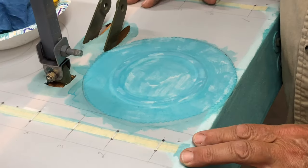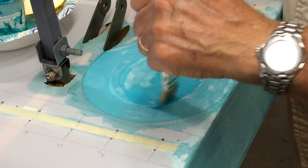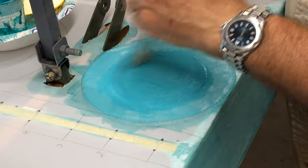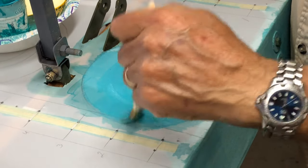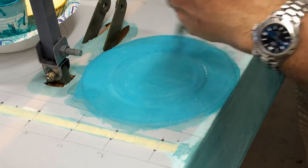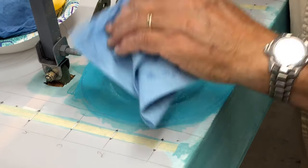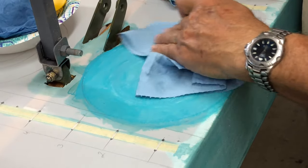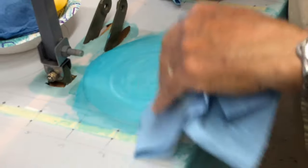So I'm going to go ahead and take my brush. Again, I'm going to take full strength glue, and I'm going to work from the middle out. This is going to be a top coating of glue. Whenever you have a top coating of glue, you must do the wipe off with the blue paper towel. If you don't, the rough glue surface you're leaving will be there permanently and it will show through your EcoFill and through your top coat. So make sure we get this wiped off. I'm working fairly quickly because I don't want this to set up. Make sure I get the entire surface wet out. Then I'll go ahead and take my dry paper towel and from the middle out grab a new one. I'm just working the excess glue off — usually about two or three wipes.